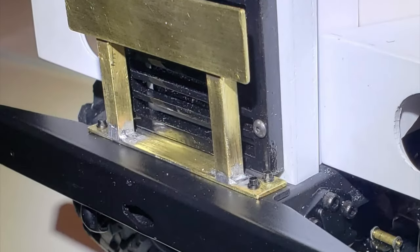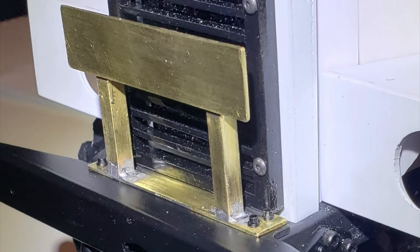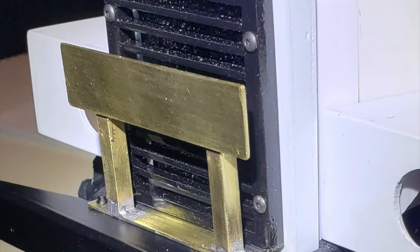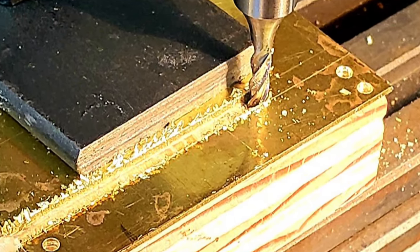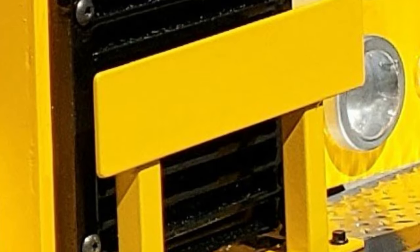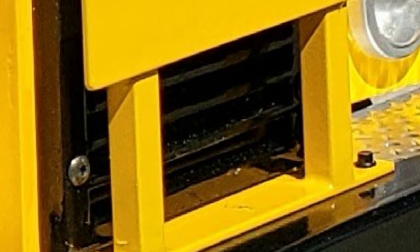The radiator guard was fabricated by soldering two 2.5-inch long strips of 1/16-inch thick brass sheet and two 1 7/16-inch lengths of 1/4-inch square brass tubing. The radiator guard's lower mounting strip was cut to be 3/8 inch wide with 4 centered clearance holes for the small 2mm bumper fastening bolts in their same 5mm by 57mm centered pattern. The upper sheet member of the radiator guard was cut to a width of 9/16 inch, with the completed fabrication as shown in this photo.